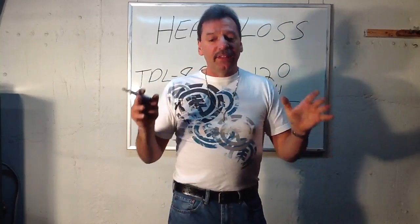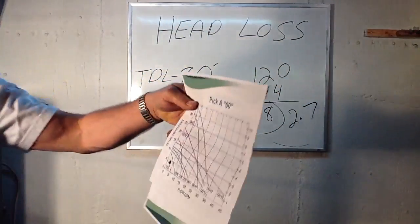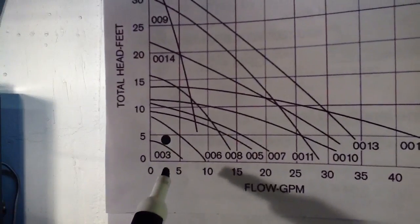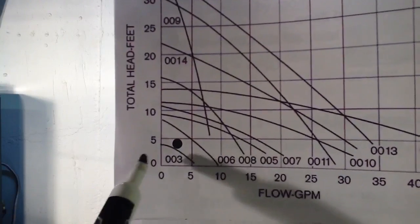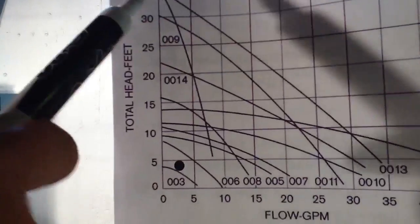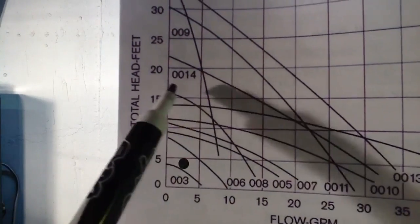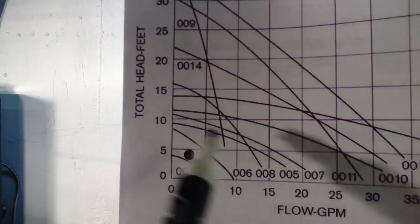That's how it's done for every zone — that's the math. Then you can go to your chart. You can see 2.7 — the flow in gallons per minute — is very, very close to the corner. And 4.8 is almost up to the 5. So we're right down in here. You can see these pump curves. It doesn't have to land right on the curve. Some are way out of sight — those would not work. A 003 would work, a 006 would work. A 008 is kind of high, that wouldn't work. A 005 and a 007 would definitely work — they're right in there. The 007 is the main one.